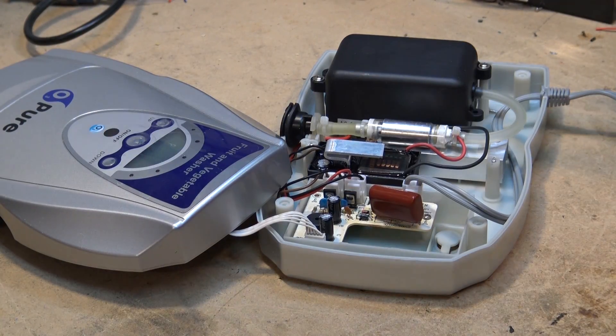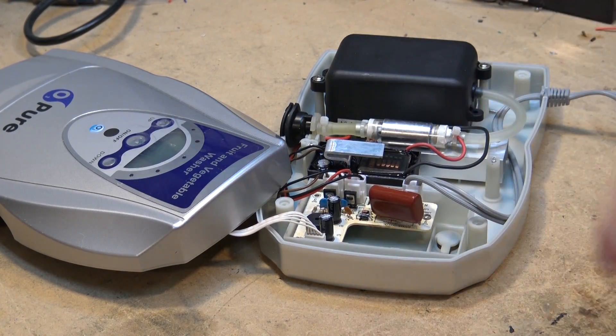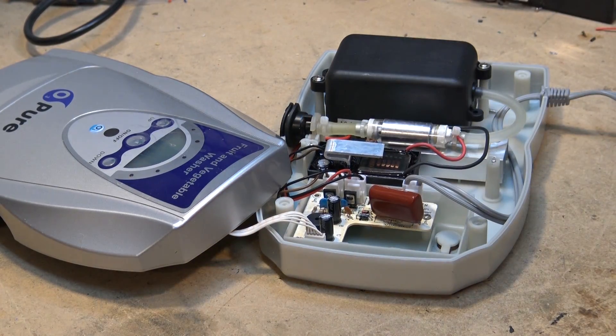For someone not familiar with how these things operate, essentially this is like an aquarium air pump. What it does is it creates a high voltage and you create a corona discharge, and that occurs inside this tube here. You have a high voltage applied to a screen inside the tube, and it creates a high voltage discharge which produces ozone. A prime example is if you use a photocopier or a laser printer — ozone is a byproduct of the high voltage used to initialize the transfer of toner from the cartridge to the drum. You can smell it on laser printers. It's basically heavy oxygen — three oxygen atoms.